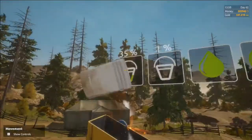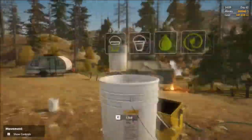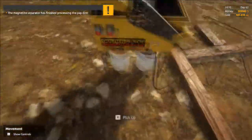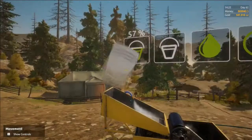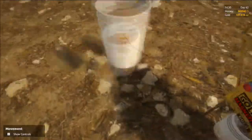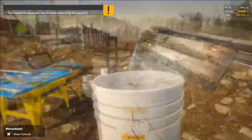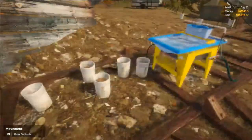The results aren't that surprising. When you run it through the magnetite separator, you get .778 ounces of gold per bucket. And when you don't run it through the magnetite separator, you get .779 ounces of gold. This is so close that you really can't say that there's a difference. It appears the magnetite separator has no effect on the amount of gold that you get from each bucket.